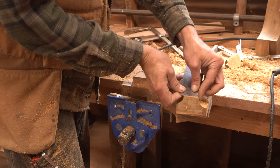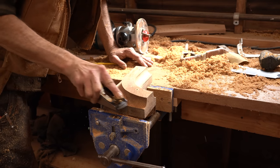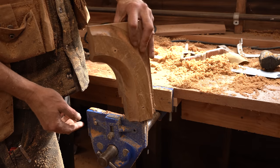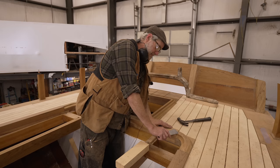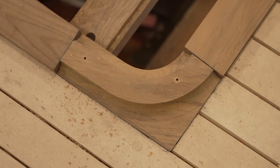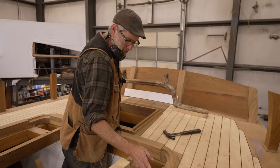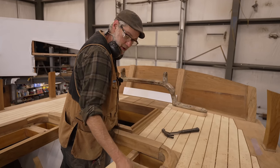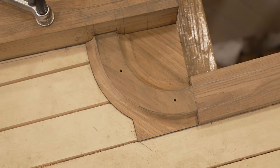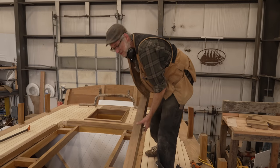Inch and a half, and a little better, which is what I want at the tip. Today, I shaped the sill under the corners. There's gonna be a nice radius corner post. These straight line pieces are going to be hopefully a lot easier to shape. I can just run the bottom bearing bit down them and all my marks are lining up, so it looks like that's gonna be that easy. Feeling good that this is going to be shaped today.